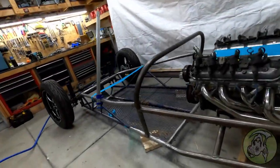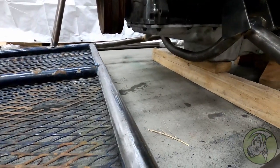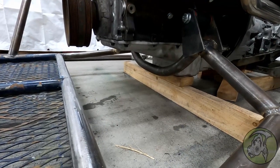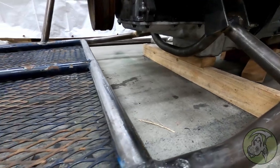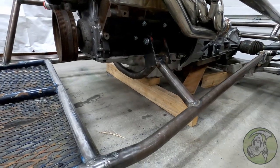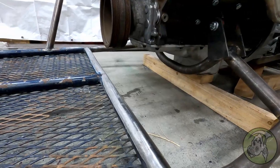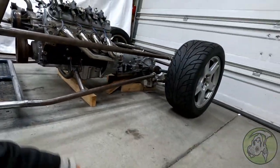So we just got done doing the motor mount. We ended up doing the double bend for the bottom hoop underneath the oil pan. It had great clearance, gives a little bit of protection too. And it's slightly above the base bar for where the floor pan's gonna be. We're probably not done with bracing this yet. As you can see, we need to actually get something that can support from the crossbar up to the mounts and start creating those nodes.